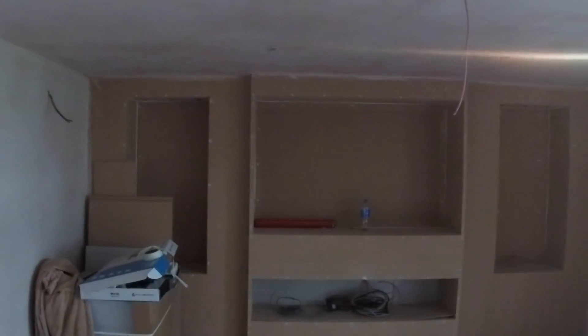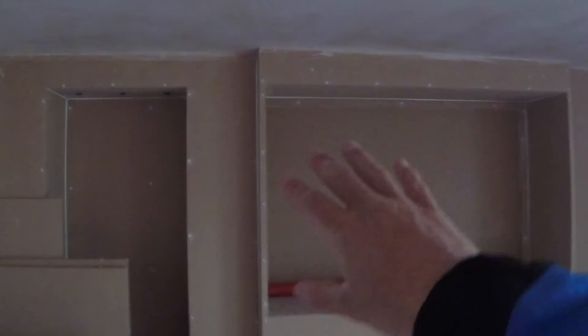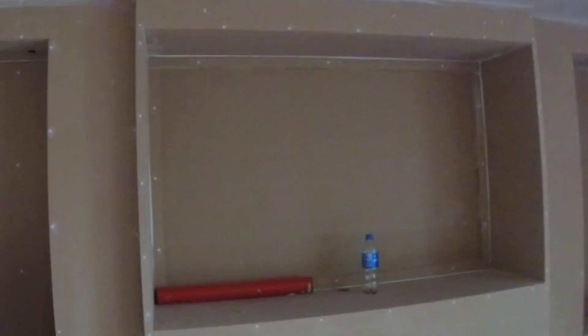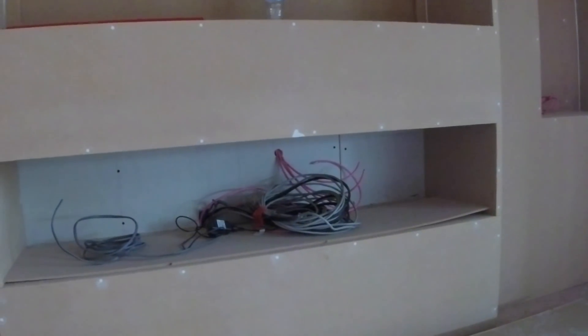The owner has decided to build this bespoke TV unit, which is going to look absolutely amazing when finished. At the top is where the TV goes — looks like it's going to be quite a big one. Down here is where I've run all the cables for the socket, speakers, Cat 6 internet, and the aerial for the Sky box. Over here he's going to have some bookshelves with glass shelves, and I've even run some LED lights which are going to look really cool when lit up. The pink cable everywhere is for speakers — I believe there are six speakers run throughout, one here, one there, more in the center of the room and by the kitchen, so you'll really have good sound.